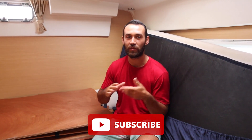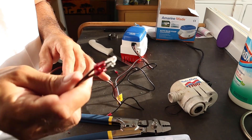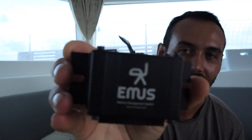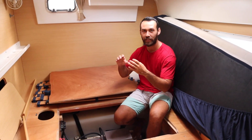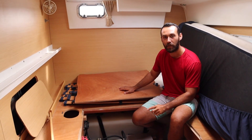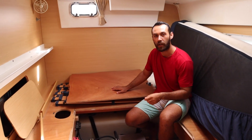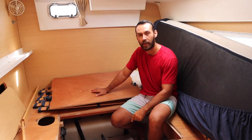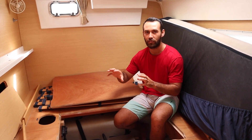Make sure to subscribe if you like this video. If you're looking into switching to lithiums or getting a boat, in the next couple of weeks I'll be doing a video comparing other brands of lithium batteries. I'll also be installing a brand new BMS on these batteries — taking them apart to check the quality of Big Battery after eight months of usage. I'll be installing a BMS made by EMUS, switching it out because our inverter requires a CAN bus communication cable between batteries and inverter for a more accurate state of charge.